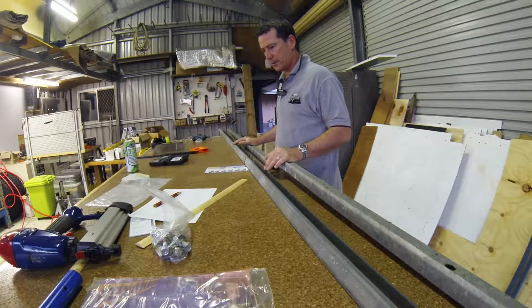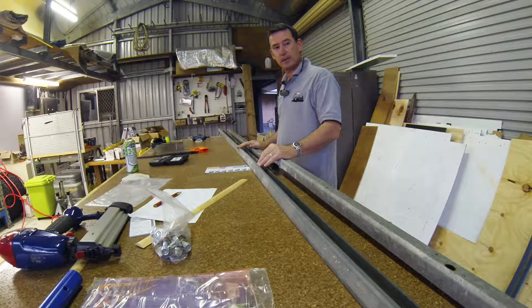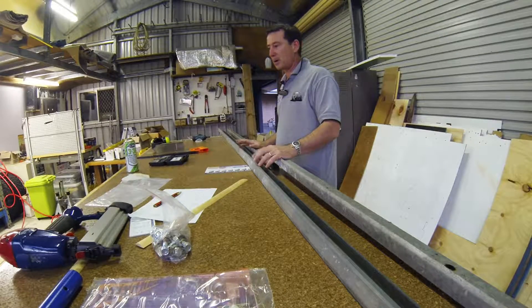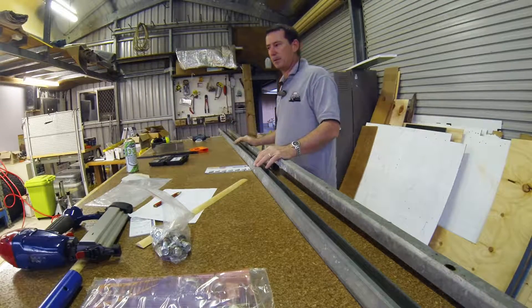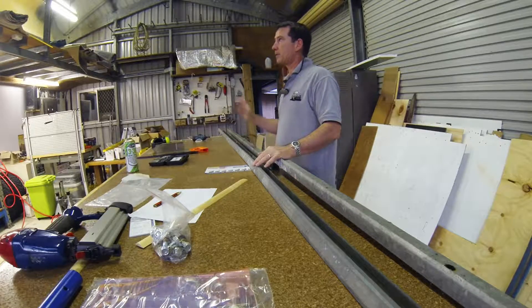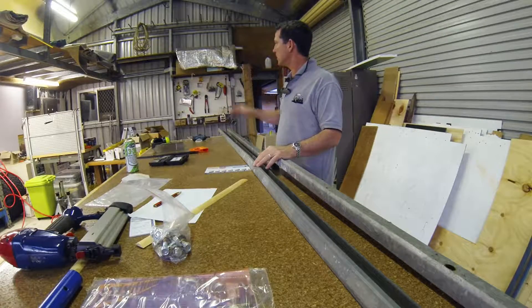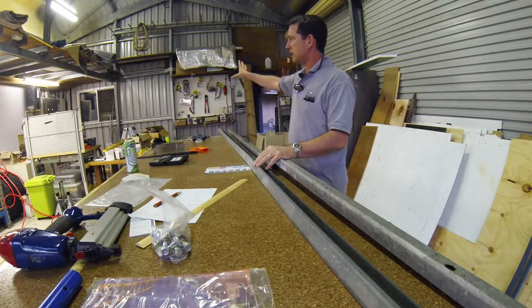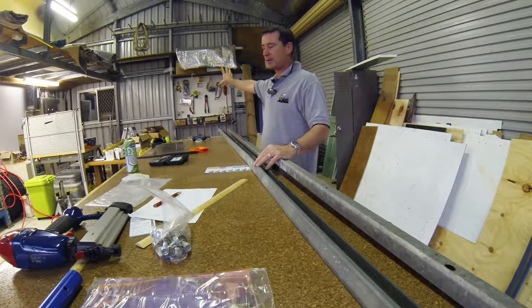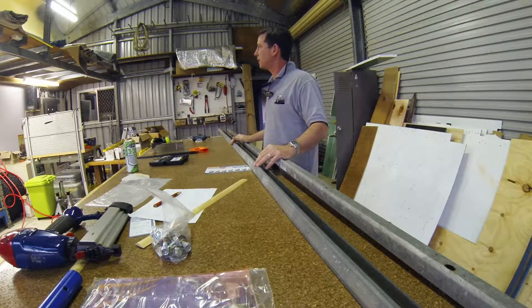A bit more to do — I've run out of time unfortunately. I've only got a few days. I've got things to do tomorrow so I won't be able to get to that. Then might be able to get some wood for the battens and the ply — probably go 12mm structural ply, same as I did on that wall there, and that stuff's solid. As soon as it's tied to the wall it's solid as a rock. I don't need to insulate behind there because there's another garage attached to it, so there's no actual weather that hits that side of the building.